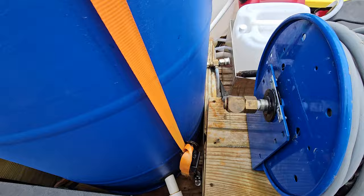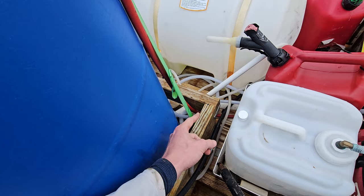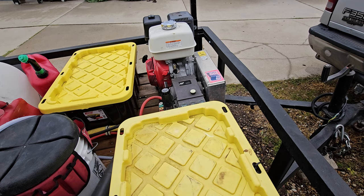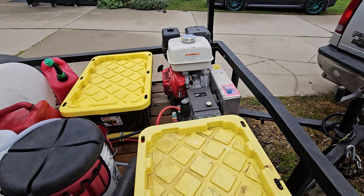We've got one-inch uniseal off one-inch PVC for both the dump and for the feed line, or intake line. I do have a belt drive, so it is drawing its own water supply — it's not gravity fed. It is a five-and-a-half gallon per minute pressure pro general pump. It works well. I bought it second hand; the guy had upgraded his setup and used it for half a season. It's made me tons of money, and I paid it off probably 50 times this season.